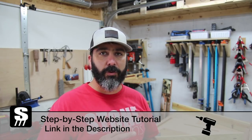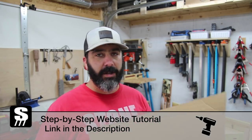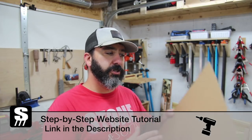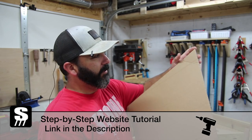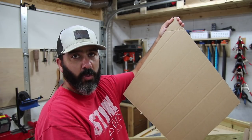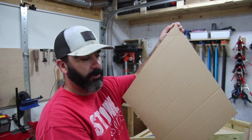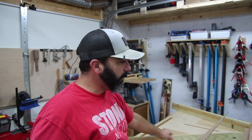I had to figure out the pitch of my roof, and the way that I did that is I took some cardboard up a ladder and just held it in place and traced behind it. There was enough room to get a pencil in to get some long enough marks to bring it back into the shop and draw these lines longer. If this is the pitch of my roof, I need to come down at least around 28 inches — that's the top of that vent in that gable — so this area is where I want the majority of that wood structure.